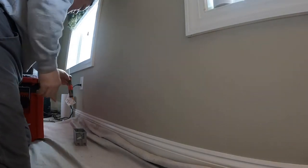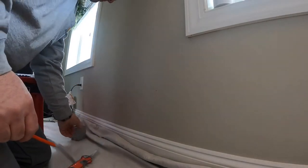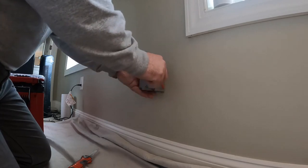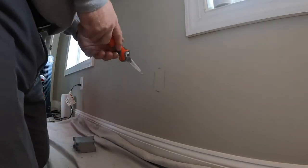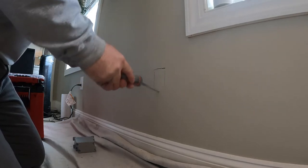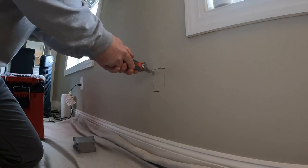This video is about installing a new receptacle for a space heater. A family had somebody move back into the house using the second-floor bedroom as a makeshift apartment. They plugged in a space heater that draws over 1500 watts, so we decided to run a new circuit just for the heater, since she had other appliances on the same lighting circuit.